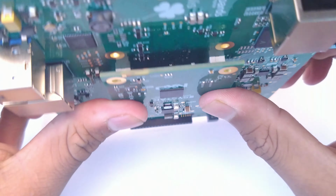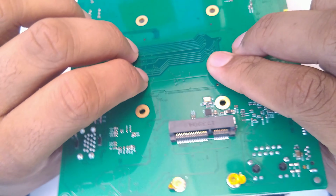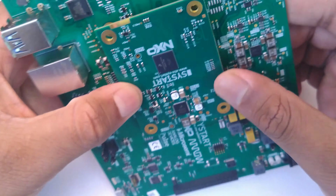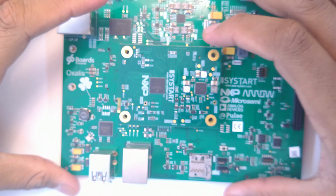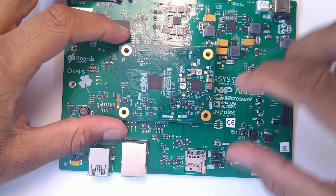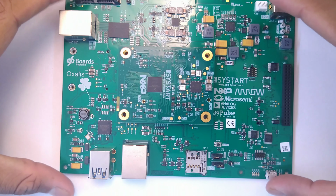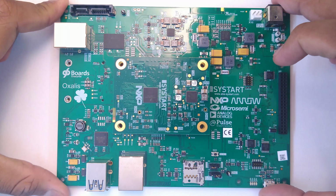You have your 2 gigabit ports that can actually make a pretty decent router, and you can add a 2x2 MIMO Wi-Fi, dual band, using the mPCIe slot. Those modules are easy to get a hold of. You can boot from USB or SD card. Again, it's all U-Boot, and U-Boot does support some form of UEFI boot as well as U-Boot DTB. So you can use that. This port is available as of now on Linux Next and is scheduled to be upstreamed on the 5.1 release